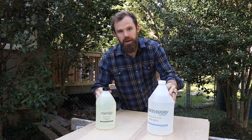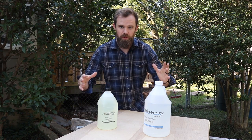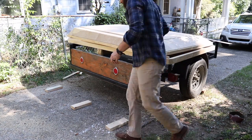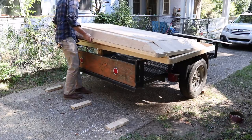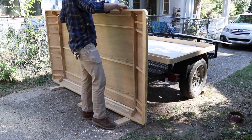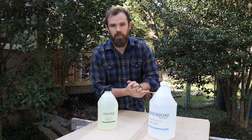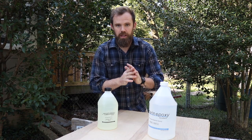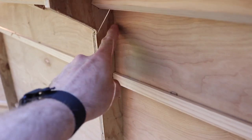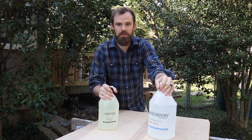It's time to break out the epoxy resin. We're going to start with the underside, so we're going to gently remove the top of the tent and lay it over on its side very carefully. Once it's on its side, we're going to mix up some epoxy resin and hardener, and then apply it to the bottom side of the tent. We're not going to coat the entire bottom side — just inside where two pieces of wood intersect. So let's get our epoxy resin mixed up.